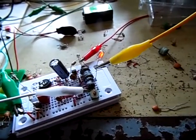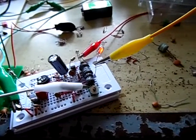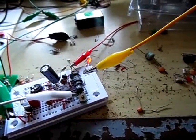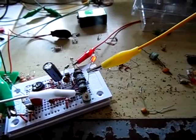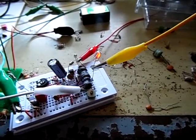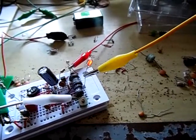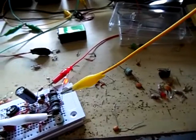The system is running on 11.9 or 12 volts and it's pulling 80 milliamps from the power supply, so there's quite some power going into the antenna. Although there's power going into the antenna, the range isn't that good — it will cover one house but probably not much further. Imagine the wavelength at around 220 kilohertz with just a one-meter (six-foot) antenna.